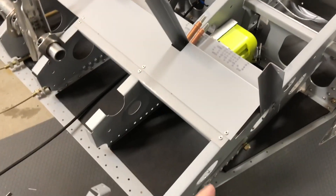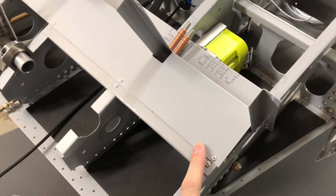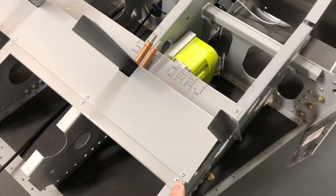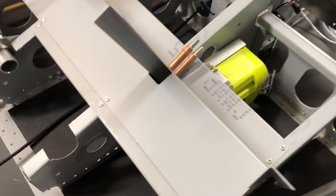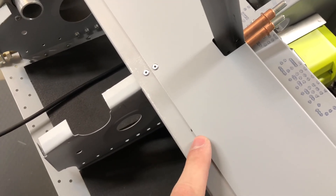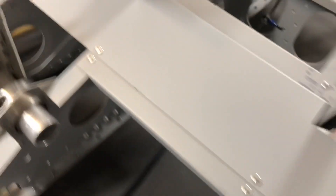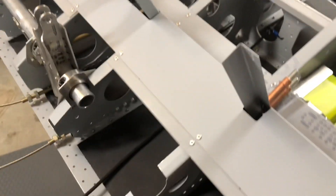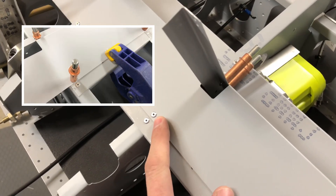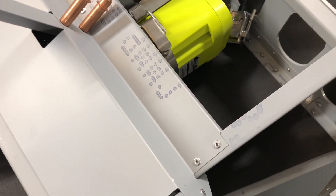On to the tips now. First thing is to make sure you follow the instructions carefully. I had assumed that this extension bracket went right on top of the existing strengthening channel, so I originally had everything clipped up to use the existing holes. But if we look at the instructions, it says to locate this extension channel 17 millimeters forward of the vertical edge of the strengthening channel — that's where that little black mark is across the strengthening channel. Then you hold it down with some clamps and drill new holes into the ribs underneath, and also rivets that go into the floor ribs.